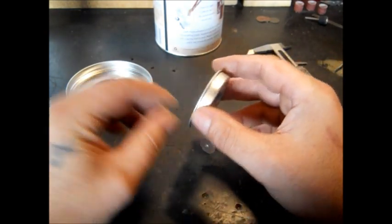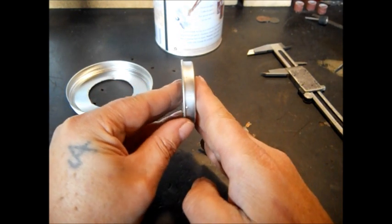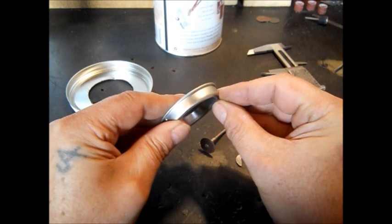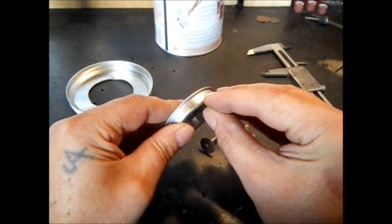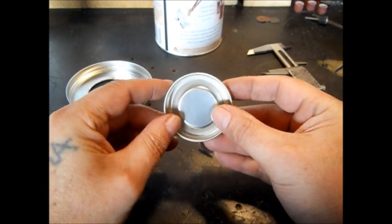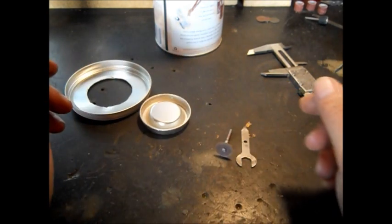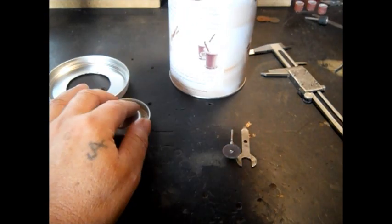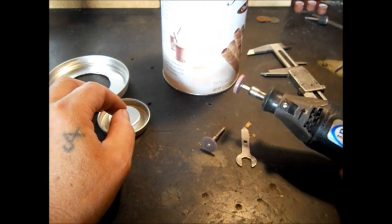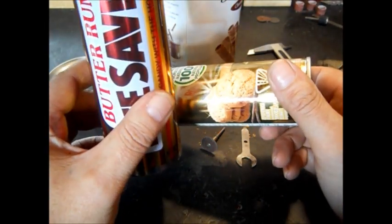That's how I do it. You can put it in a vise or between two blocks of wood, but we're going to do it free-handed. I always draw a line with my blade first, then cut deeper — I don't cut through all on the first pass. I draw a line first; it makes like a valley for your cutter blade to follow. Same way with big four-and-a-half inch grinders on metal — always grind your line in there for the blade to follow. Okay, enough of that explanation. I'll be doing the same thing on the hole here too, making a little pattern where it has to be.